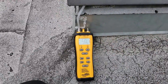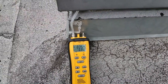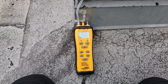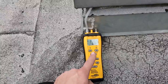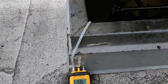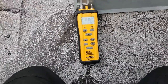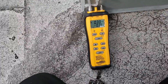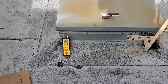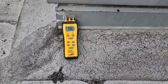Taking a measurement now — that's the negative air pressure in inches of water column. We're reading 0.35 inches of water column of negative air pressure on the building with all doors closed. Every once in a while someone opens a door and the pressure drops. I'll open the roof hatch real quick and you can see that number drop very, very low. Closing it back down — 0.35 inches of water column of negative air pressure. Someone must've just opened the front door and now they shut it. It's crazy.